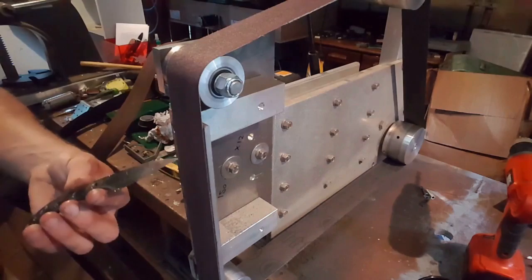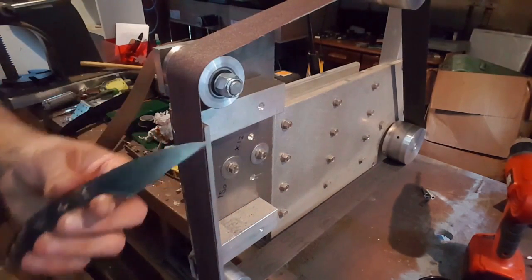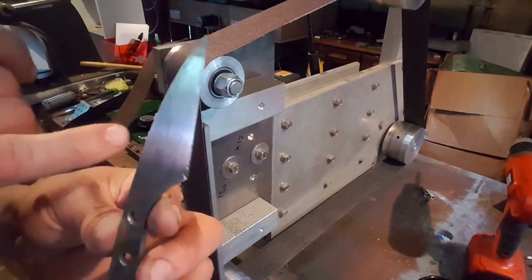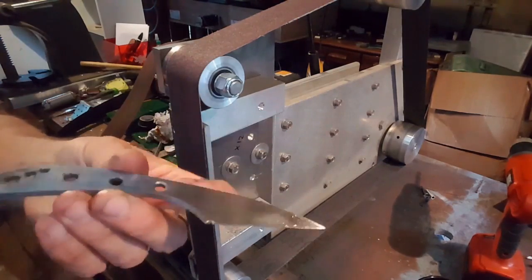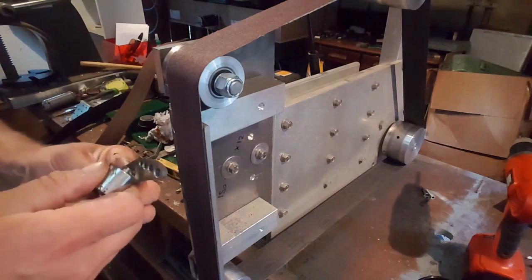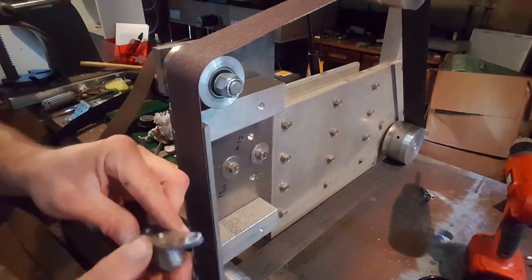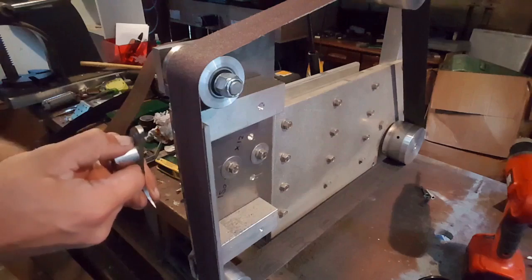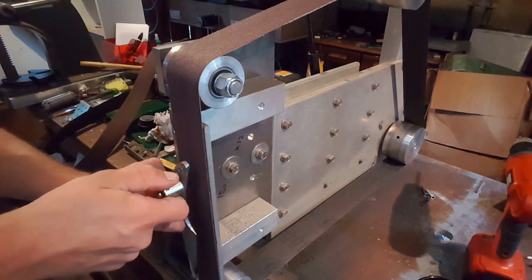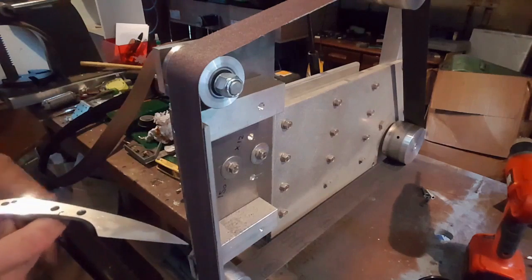Okay, so before I do the heat treat, I'm just doing a bit of basic surface finishing on here. I don't know if you can see, there's some odd scratches going on in the center of the blade here. My method is, I've got an extremely strong neodymium magnet with a screw through the middle. The screw indexes into one of the holes, which saves the whole blade from dropping down on me. Then I'm going to run the linisher and very gingerly offer it up onto there and allow that to clean up these surfaces.